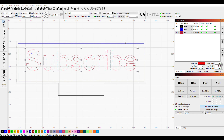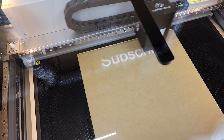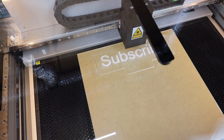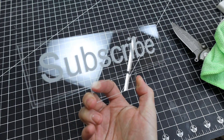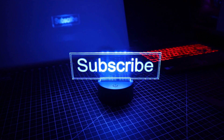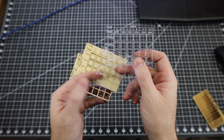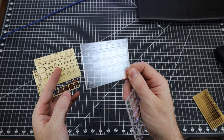As you can see, I'm fully designing an edge-lit sign in the software. I'm cutting this out of 3mm clear acrylic. When it comes to the text, I'm engraving that. And unlike diode lasers, CO2 lasers have no problem cutting any clear acrylic, and it leaves really clean edges too. Here's the sign with the paper removed and cleaned up. If you put this into one of the light pucks, it should light up — and if I turn the lights off, it looks a lot better, it's just too bright in here. If you are using Lightburn, you're going to have to figure out your own settings, and these test cards are perfect for that. I have links to these in the description and you can download them for free.